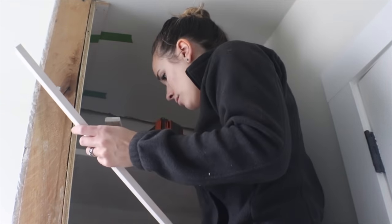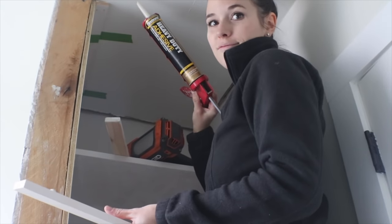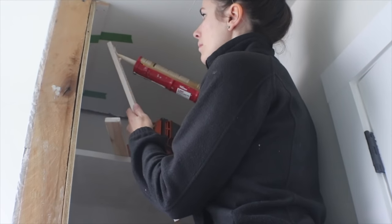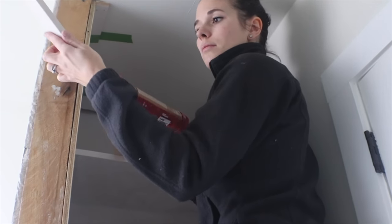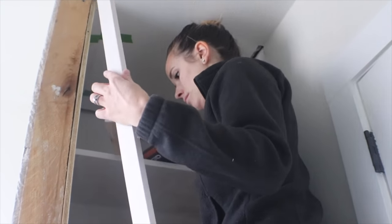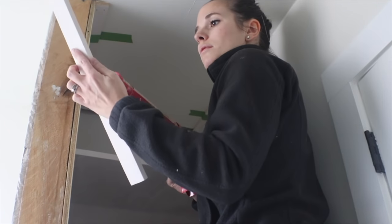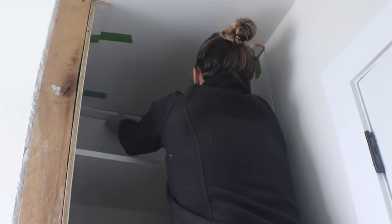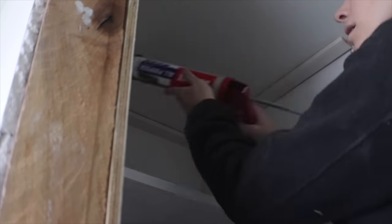Before I could paint I needed to fix the gaps in the ceiling. I cut little strips of pine and pre-primed them. The ceiling is actually plaster with chicken wire, so I had to use a heavy-duty adhesive and tape these pieces into place instead of nailing them — I tried to nail up into the plaster ceiling and my nail bent and shot back down, which was kind of freaky. These strips are covering the nasty edge where I couldn't get the plywood to match up with the ceiling, since nothing works with drywall mud on this plaster.